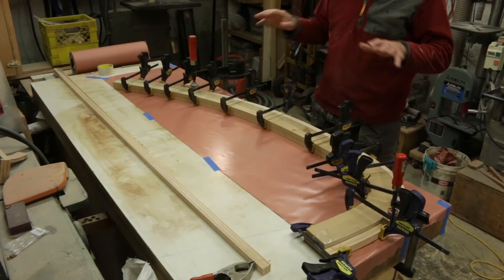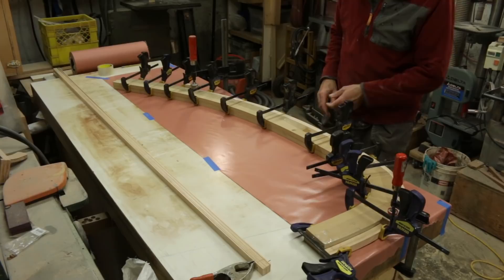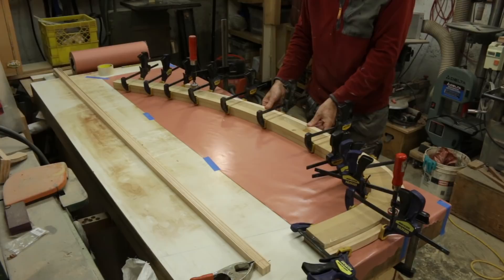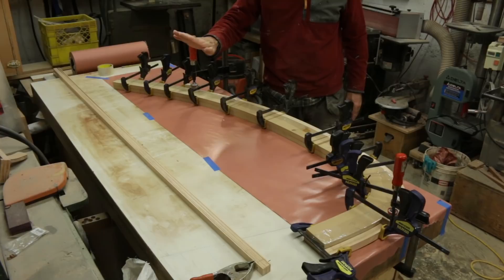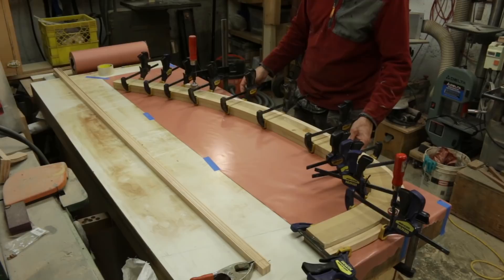One thing I'm doing is I'm going to laminate a little bit of the deck camber into this right off the bat. I've got about 5/8 of an inch of crown being built into it. Down here at the center line it's touching the table, but up here at the extreme beam it's about 5/8 elevated. That's roughly the deck camber we're working with at the center of the boat. So it's not 100%, but it's better than if I just bent it straight - all the best I could do then is force a direct angle up onto it and miss out on the fact that the deck actually has a bit of a sweep this way.